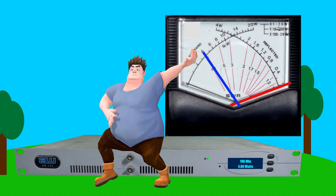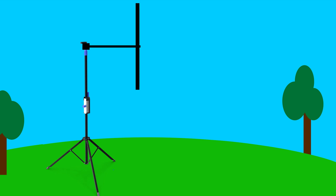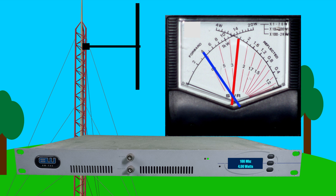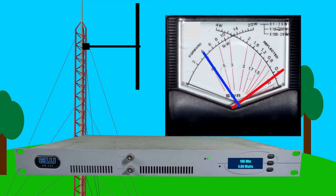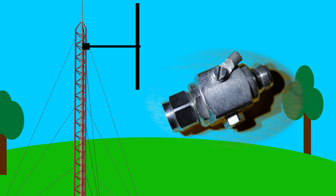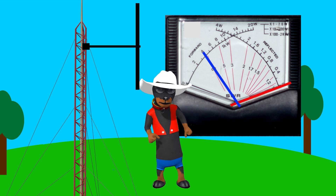Once you have tuned the antenna to its best SWR ratio of as close to 1-to-1 as possible, take it off the stand and install it on your radio tower or pole. Then check your SWR again when it's installed. If there is a huge change again, check the cable with a multimeter to see if the cable is faulty. If it's a small change, check if there is anything nearby, like a metal pole or structure that can be reflecting the signal back into the antenna. Also, be sure to earth the tower, your cable, and the transmitter as best as you can. Finally, don't forget to put a lightning protector in to save your transmitter from lightning. And you've got a fully tuned FM antenna to broadcast with. Well done!